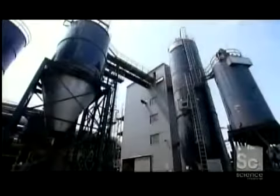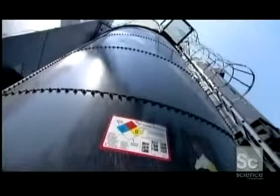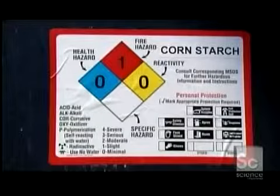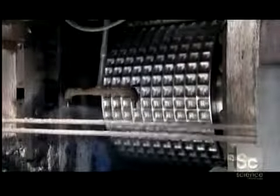The mix, now blackened, passes under a second electromagnet to remove any metal that could damage the equipment downstream. Finally, workers blend in cornstarch, which binds the ingredients together. A worm screw supplies the mixture to a press roll, where a constant spray of water keeps the mixture from sticking.